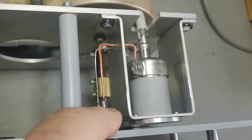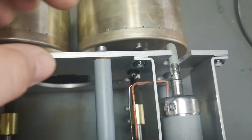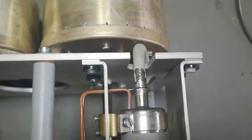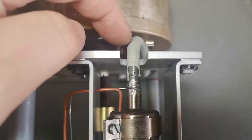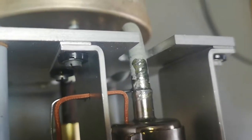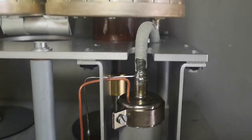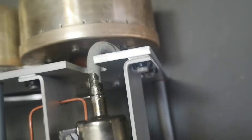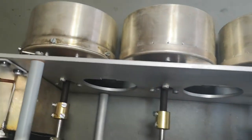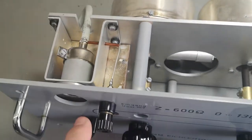The output connector chassis is not connected to the front plate but is connected to this plate, and then there is a shielded cable — this is actually lead, which is amazing because you can solder onto it. This lead coax cable goes into one of the three attenuators.